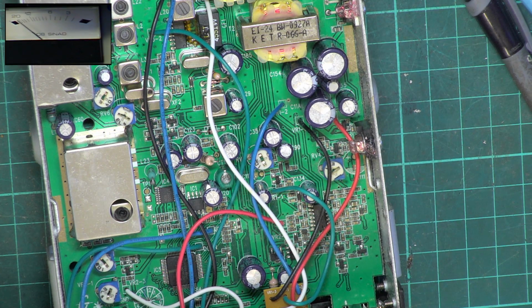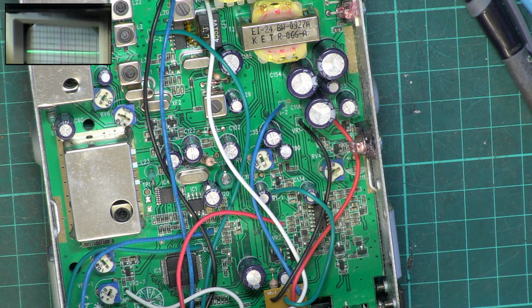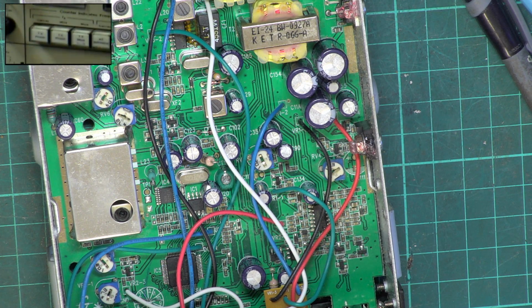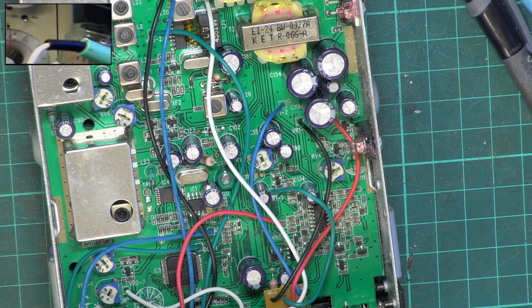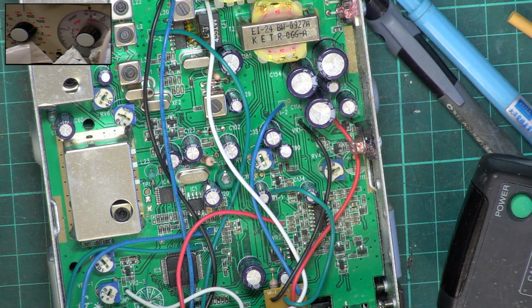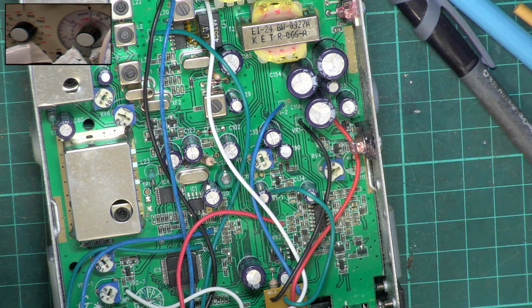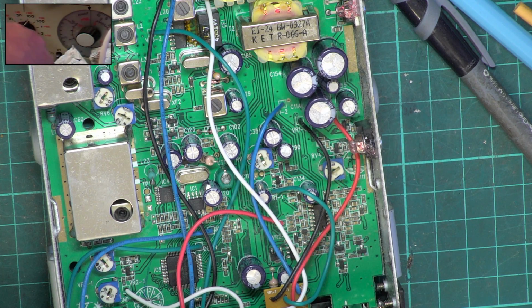Right, I'm going to put squelch to full, and we'll see where that comes in. So we may as well pop this down onto the attenuator controls, so you can see me wrestling with the attenuator. So at the moment we're on 1 microvolt and we've got the squelch on full. I want the squelch to come in on full at S9, which is 100 microvolts. So it's 1, 3, 10, 30, 100, 300. So that's 2 coarse.